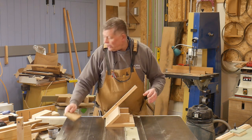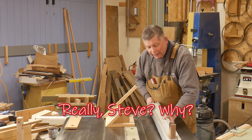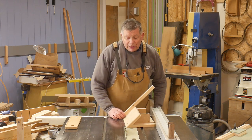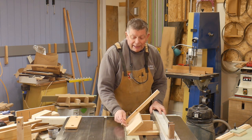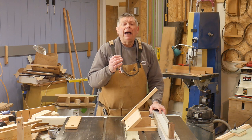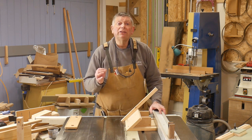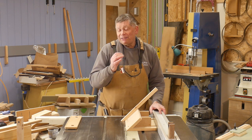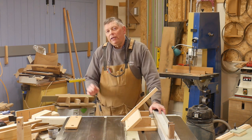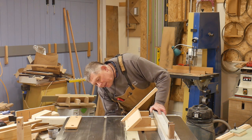This jig runs with the fence on the left-hand side of the blade, so my fence goes over here for this job. I've got a very slight gap — three millimeters or so — between the edge of the jig and the saw blade, and that's important. When putting the spline internally, I don't want to be right on the inside edge of the corner, but I do want it closer to the inside edge than the outside. If I get very close to the sharp corner, I risk coming out on the face of my box. Three or four millimeters is ample for most boxes; then you work out how deep you need to go and set the blade height accordingly.